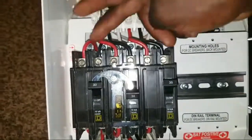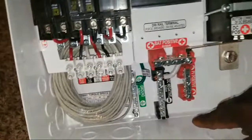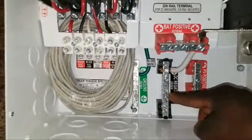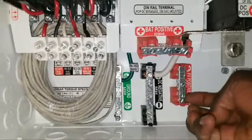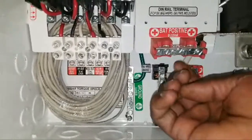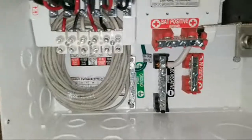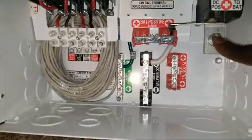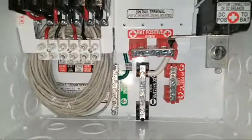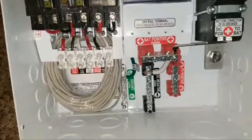These are all the AC bypass wires for the 240-volt — red, red, black, black — and you have the neutral here for bonding. Down here you can see the bus bar for the neutral. You connect your buses here for your solar panels and charge controller coming in. PV positive comes here, and the battery connection comes through this one-and-a-half inch knockout — two big wires coming in and attaching to the bus bar, distributed to the terminals. Multiple charge controllers can also connect here.